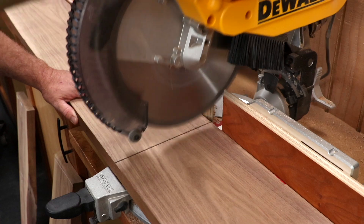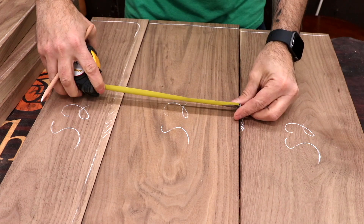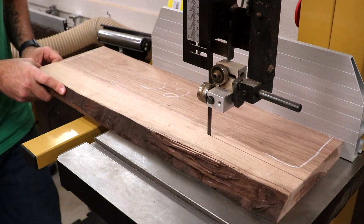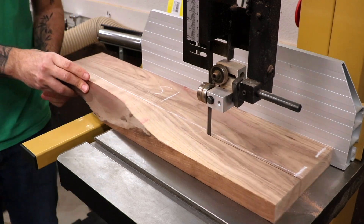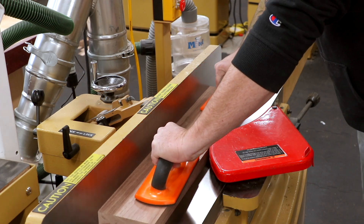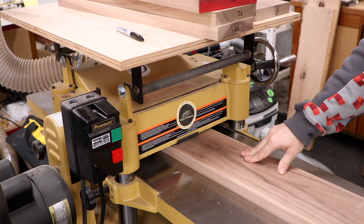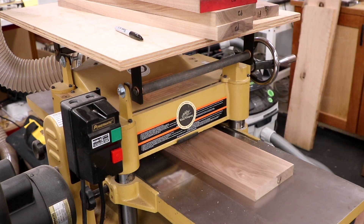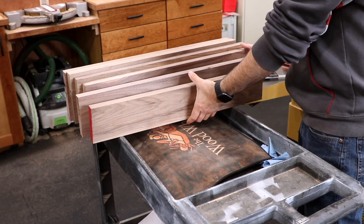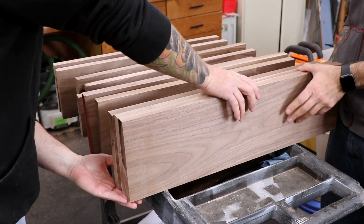Everything is cut oversized in length. Most of the panels will be a glue-up of three boards, so I lay them out, define the areas I want to remove, and check that we still have enough width. We'll mill the boards four square in preparation for glue-up. I'm using five-quarter stock for this project, but you can get away with four-quarter. Five-quarter is nice because the parts are beefier and you don't have to worry as much about removing too much stock when milling flat. Because we don't have time to glue up the panels today, we're leaving the parts oversized and letting them sit until we're back in the shop.